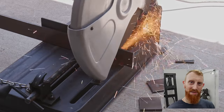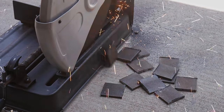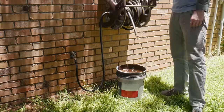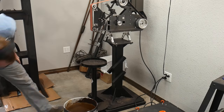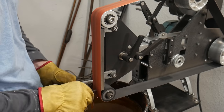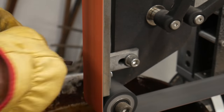We're just getting started cutting out some pieces. I'm using the abrasive chop saw here — this is before I purchased the cold cut chop saw I reviewed in my last video. The pieces I cut out were two by two by a quarter inch thick, and these are going to be the top and bottom of our leveling feet. Since the abrasive chop saw leaves a little burr, I took everything over to the two by 72 belt grinder from Northridge and cleaned up all the edges. I wanted some rounded corners as well.